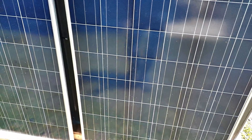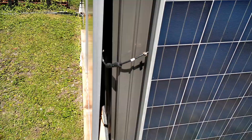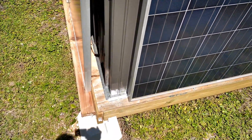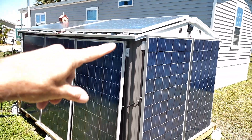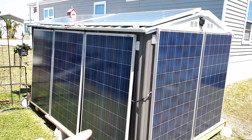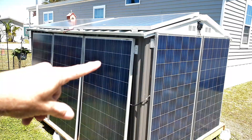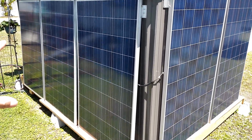Since they're sitting vertically, this supports all of the weight and none of the weight actually sits on the shed. They do have a slight tilt back towards the edge of the shed — it's a little closer at the top than at the bottom. That is by design so that the sun as it comes in for the evening will start to hit up here as soon as possible, because as it goes over solar noon the sun's going to start moving up this panel to hit the top.